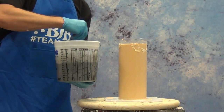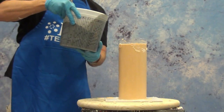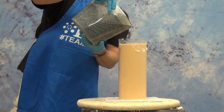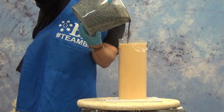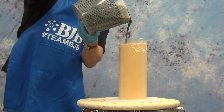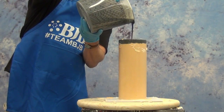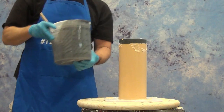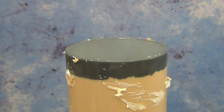Now ready to pour that into the alginate mold. An important step not shown here: if you're working with a wetter alginate formula, it's a good idea to flip the mold upside down and drain out any moisture that might accumulate in the fingertips. That's one of the reasons I'm using the 590 for this application — some alginate formulas have different fillers that retain moisture differently, and those can contaminate resins very easily because they trap in a lot more residual moisture than you get with AccuCast formulas.